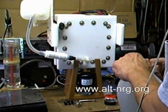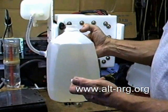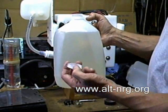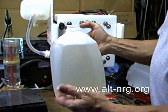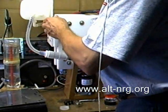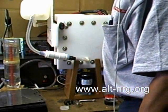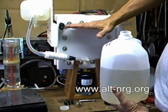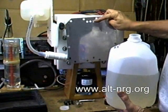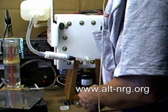This cell has been drained right now, so I am just going to show you how easily this cell fills up. This electrolyte has been premixed. It is a very weak concentration of potassium hydroxide and distilled water. It is so weak that I have no reservation about getting any of it on my hands and waiting a few minutes to rinse it off in clean water. All you have to do to fill this cell up is fill it from the top. When the cell begins production, gas forms at the top of the cell, exposing the gas outlet holes at the top of the plates and lowers the amount of leakage in between the plates. So that is an added benefit of the way this cell is designed.